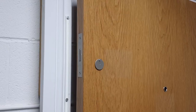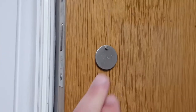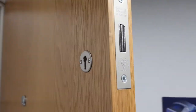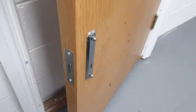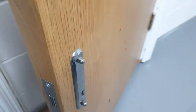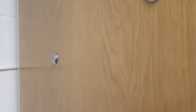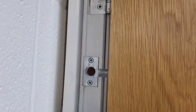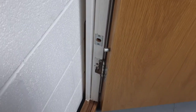Opening the door reveals three locks. The upper one is an ERA five-lever British Standard mortise deadlock fitted with standard escutcheons — one on each side of the door. Further down, we have the same lock but instead of escutcheons we have deadlock reinforcers — these devices with bolts on the inside and a plate on the outside. We also have hinge bolts, with a plate that receives them, and a door viewer to see who's outside.